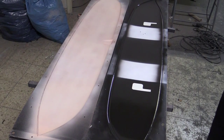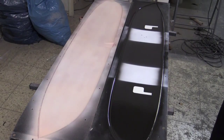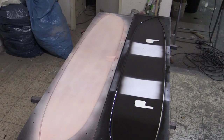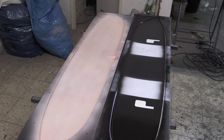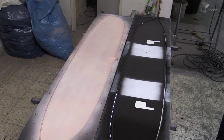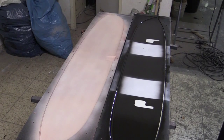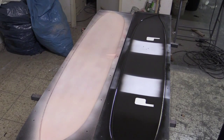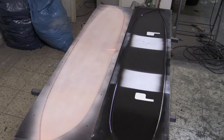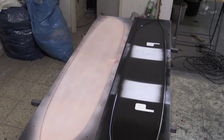This is Alex's place and those are the molds for the wings. You can see they're already painted — Alex is using IMC paint from HP Textiles. Where it's black there's actually clear coating. You can also see some white, which Alex uses behind bright colors like yellow for better vibrancy. He has waited at least 12 hours after spray painting.